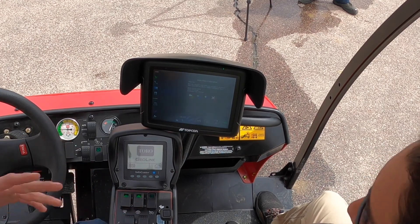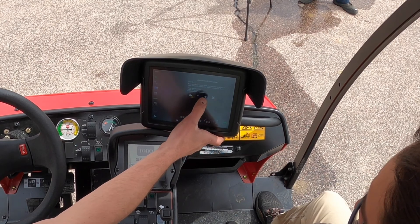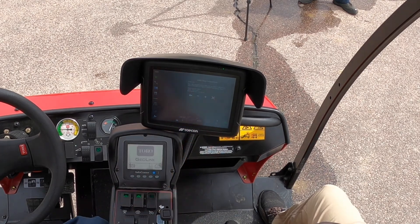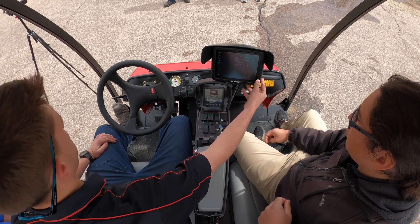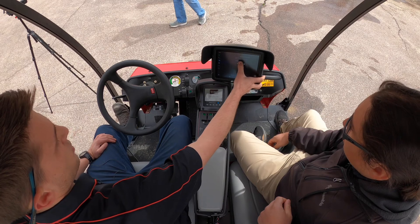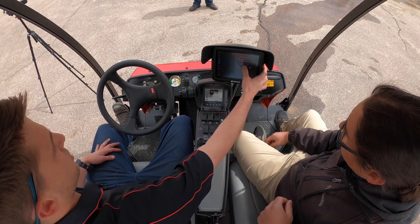So no more adjusting numbers up and down. The only thing we need to mainly watch is making sure that 42 PSI stays right about there. The plus and minus here are the manual controls for the pump, so if for some reason it slightly dips or goes up or down we can adjust it. Once we hit that time limit, we'll tick this green button on the bottom right — which is our master button — so you see the yellow arrow turns up, we hit it, and enter the amount of volume captured. The math equates to 60 gallons, we hit the check mark to continue.